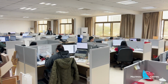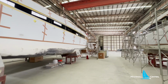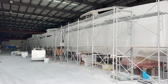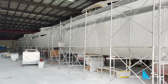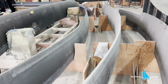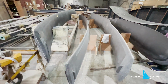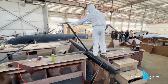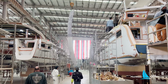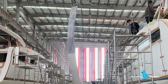We had a team of engineers working next door, drafting plans of every item and option on the boat ready for installation with precision. With half a dozen 44s currently under construction for Aussies, we took some time out to look around. Firstly, the lamination shop is incredible with the pre-preg carbon fibre oven-cured construction of these huge asymmetric daggerboards, longeron and crossbeams, and other components. This construction is seen in America's Cup yachts and provides the stiffest and lightest parts.